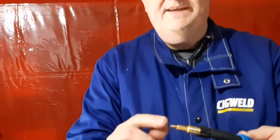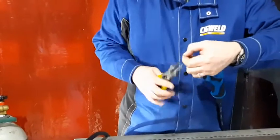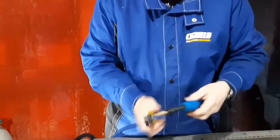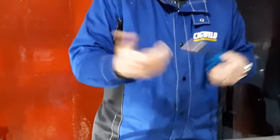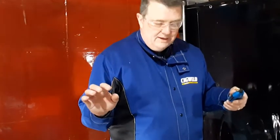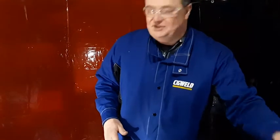So what we should do is cut that down a little bit. We grab our MIG pliers and pull it out a bit further, because when the tip goes in it'll compact it a little bit. Put the contact tip back in and basically now we're ready to put it back on the machine, hook up the aluminium wire, put the right U-groove roller on for the right size wire. We're also going to change shielding gas — we're going to go to straight argon, not the argon-CO2 mixed gas we've been using for the steel.